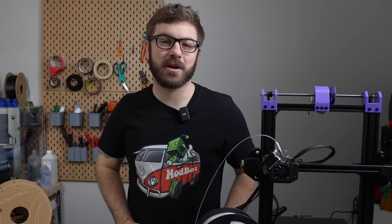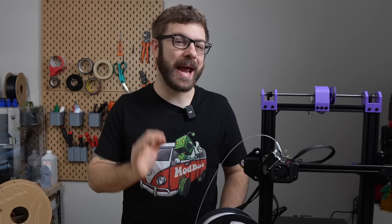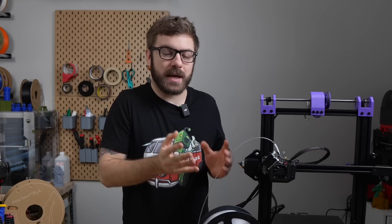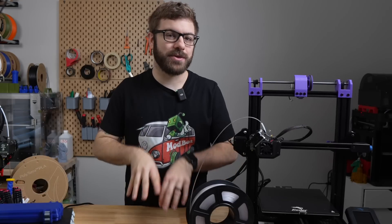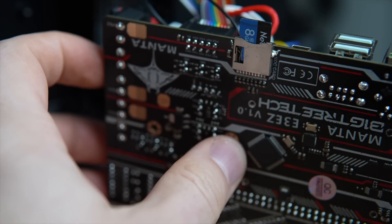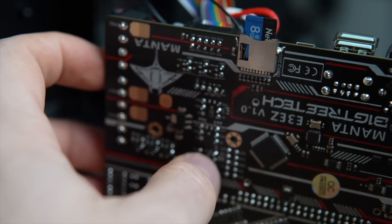When I went to install the microSD card back into the slot, I saw that the microSD card slot was hanging there. It was still connected on the back, but one of the back legs was in the air, and both of the larger front posts were completely separated from the board. After inspecting it, it looked like there wasn't any damage to the board itself — it was all in the solder joint. So I grabbed my iron, a little bit of solder, and soldered back both the posts and that one leg on the back of the microSD card slot.